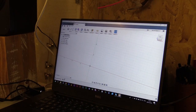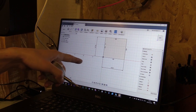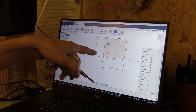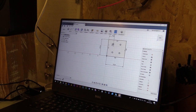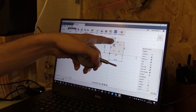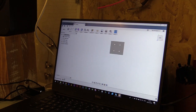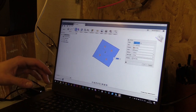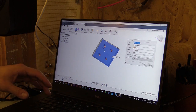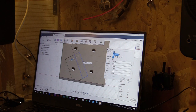Just to backtrack — I've created a new sketch, made a rectangle that's 50mm across by 40mm. I then created the holes using the circle tool and the rectangular pattern, which you can find in the sketch tab, and offset the holes so they're in the centre. Then I extruded that — although I forgot to create a new component as usual, so I'll click on that again, E for extrude, 6mm, new component, OK.